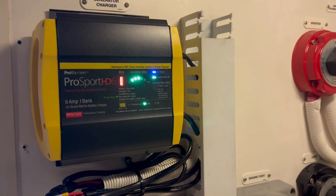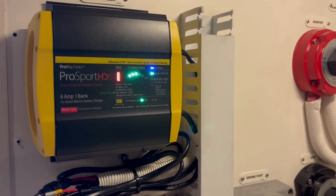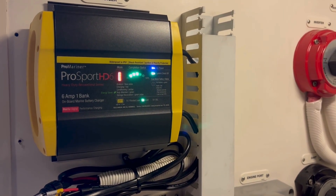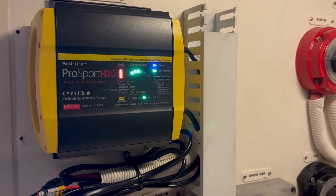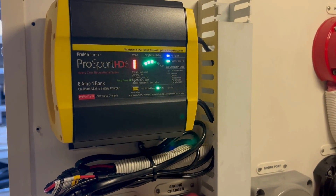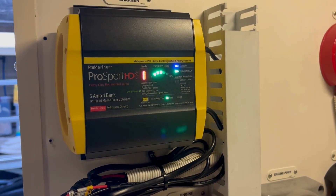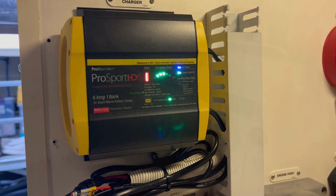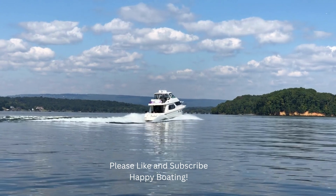We've plugged in the power — the battery charger powered up fine, set it for AGM batteries, and it went through a self-check; everything looks good. The battery looks good — the red vertical line tells us we're charging, and the green array, when all those are lit, means it's fully charged and will drop to trickle charging. Everything looks good. Good installation — hope this one lasts as many years as the first one did. Thanks to Freebird subscribers and friends; we really enjoy reading your comments about places we visit. Please remember to subscribe and give us a like.